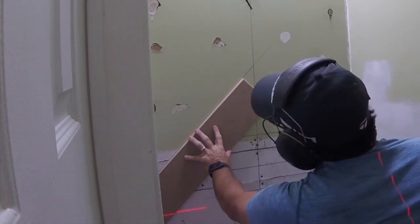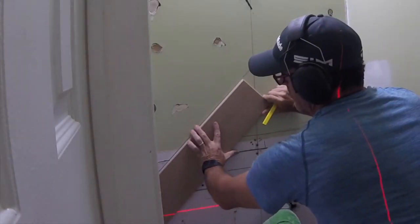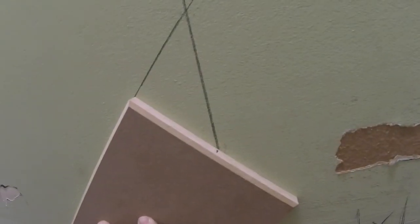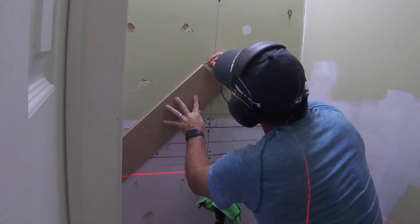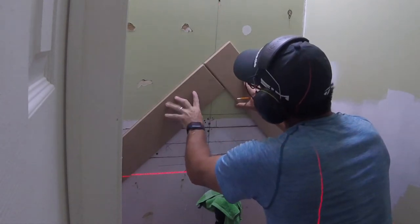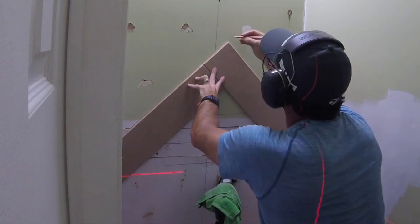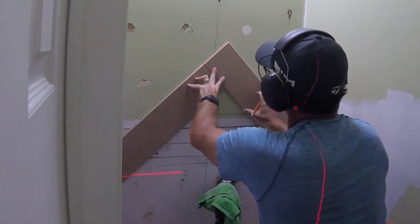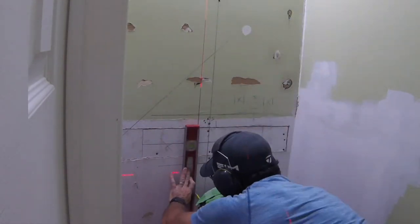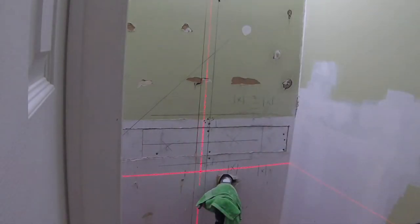The center of the first rectangle is going to be on that center line, so I measured and found the center of the rectangle so I knew exactly where to put it. I thought it would be a lot easier if I marked out two more lines where the top corner of each board is going to sit. I held the first one in place, carefully stacked on the next one, made sure it was perfectly flush and marked that. Then I used my laser level and transferred these lines onto the wall with a pencil. This makes it straightforward to keep stacking blocks up and down from the first pieces.